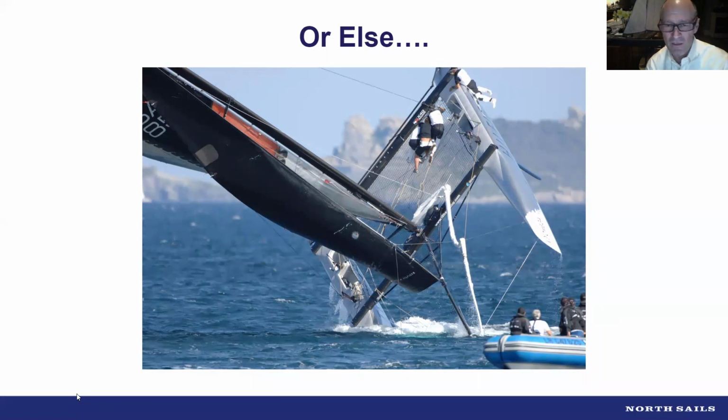I don't think in the 2013 America's Cup we would have talked about how unbelievably stable the 3Di sails were on the AC75, and we didn't think we could have made the sails to take those loads and be that flat. We were sailing around with jib cambers of 4.5%, 5%, mid cambers when, with 3DL, we were having trouble to get 8% deep sail. So the technology is unbelievable, and the technology we have at our fingertips and that we as sailors and our customers have is really outstanding. And just look at some of those 3Di videos. Every time I go to the factories that make the sails, I'm always like, wow, we get to use this stuff to make a sail?